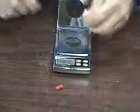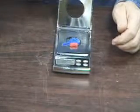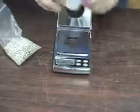The model and an extra piece of wax representing the button are weighed. These weigh 9/10 of a gram. Sterling silver has a specific gravity of 10.4, so 9 grams of casting grain are being used.